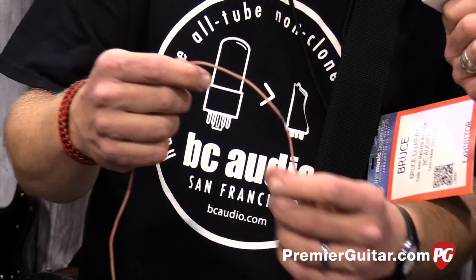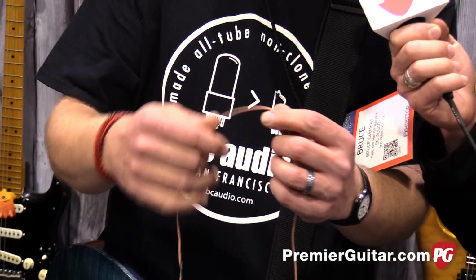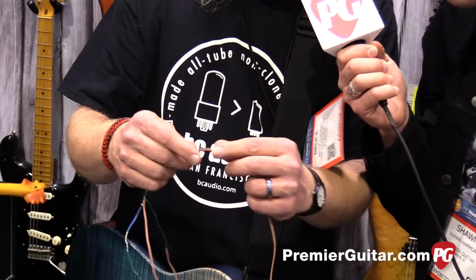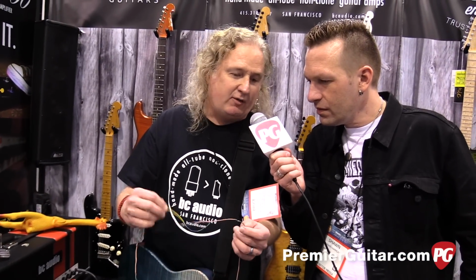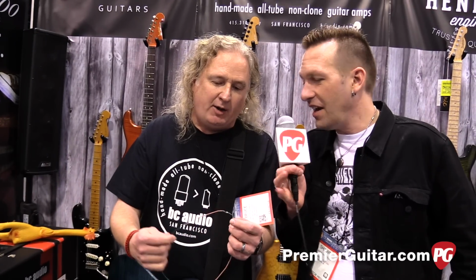They connect to the tube sockets, and I'm not even including any wires from the power supply or any DC, or any even ground wires. There's 10.5 feet of wire. I strung them all together and measured it. 10.5 feet of unshielded signal carrying wire in that amp, which is really a simple amp. And it's still a hand wired amp. Yeah, that's still hand wired.